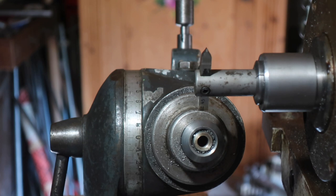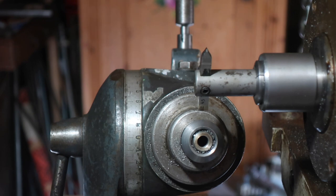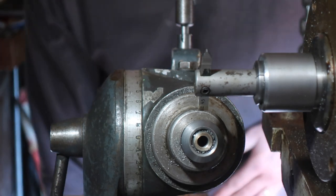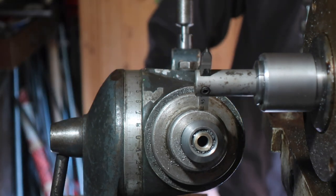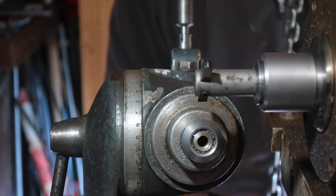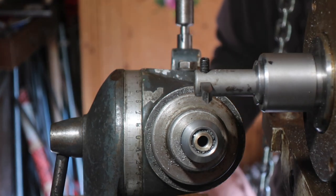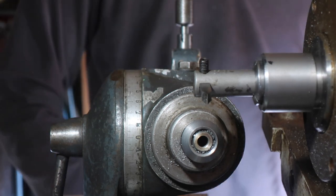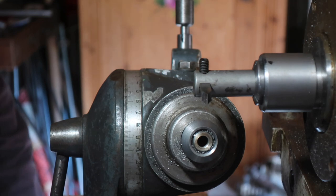So that's the right way around. You need to go backwards and forwards between different measuring systems, which is not fantastic, but it's one of the evils we have to live with. There we go, that'll do. Now then, let's set a height. I've just done it anyway, so might as well. I'm going to gash it with a slitting saw — I was going to go in direct and cut this direct, but I might as well gash first.